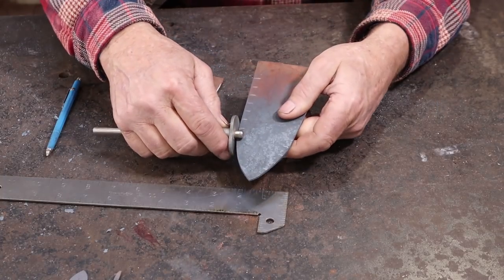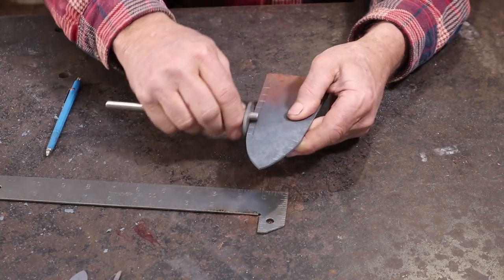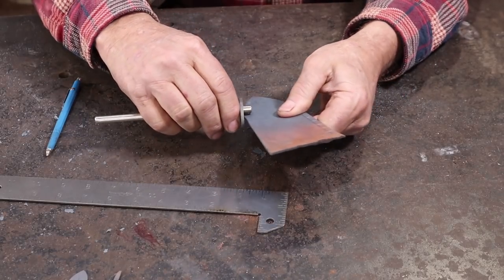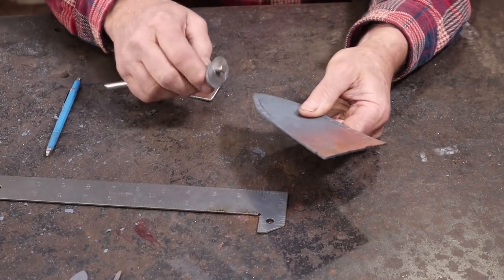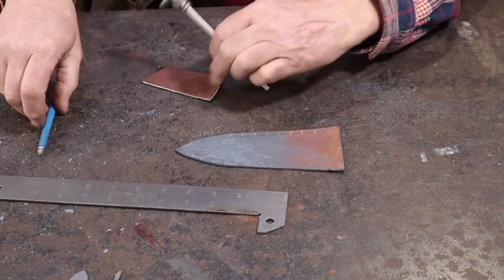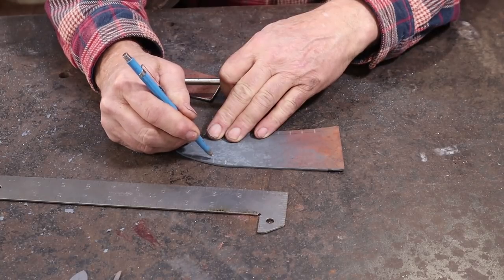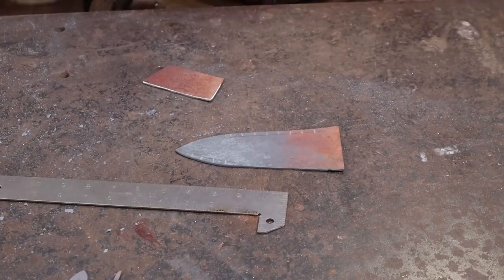And then I'm going to take my little gauge here, and it's set at 1/4 inch, and I think I'll just leave it there. I'm going to drill a hole at each one of these points, which I think I'll probably drill a 3/16 hole. And that'll be at each place my gauge line intersects this line. And then I'll cut into those and that will form our teeth.